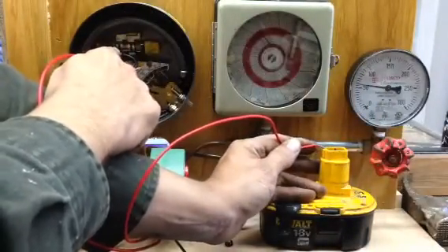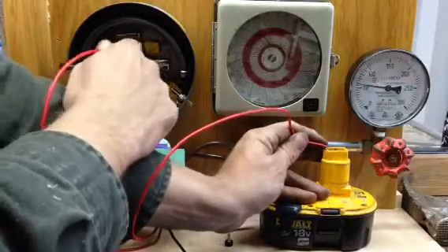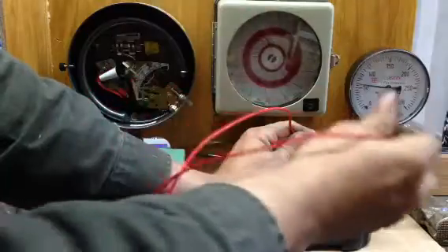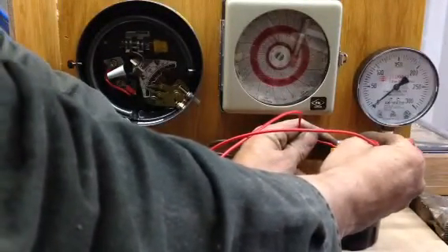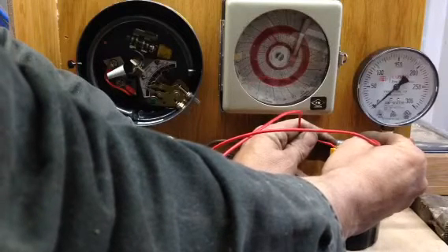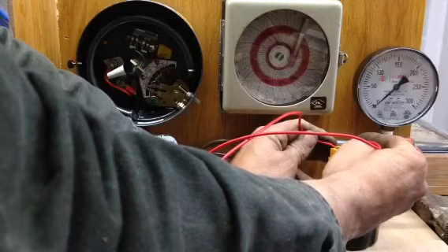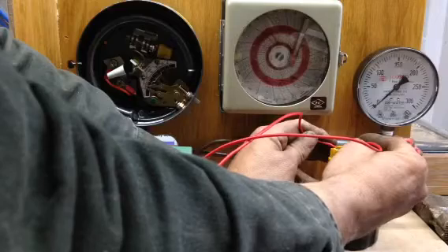Watch the vial of mercury. Right now it would be in the off position. As it flips over, it completes the contact, which would cause the pump to run. And when pressure returns, what is referred to as stop pressure is that point which, when achieved, it resets. So think of it as a reset pressure.